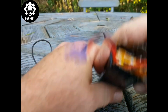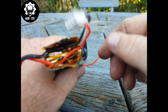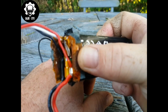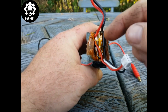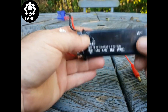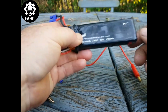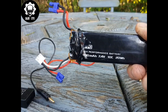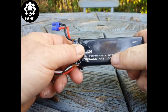When we look inside the battery — that's why it's open — you can see that little bit of green in there. That is one of the two voltage regulator boards inside this battery. You might be able to take these two boards out, desolder and resolder your leads back together, and make this battery non-regulated. But it'll still be a 10C battery. I recommend a higher C battery if you're flying aggressively, using manual mode or altitude hold mode, carrying a gimbal, or running high-pitch propellers.